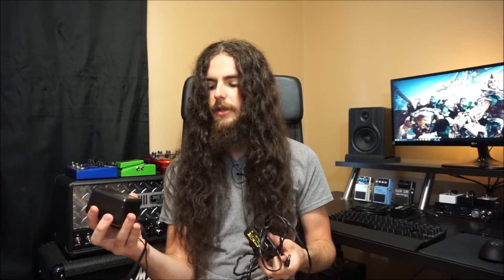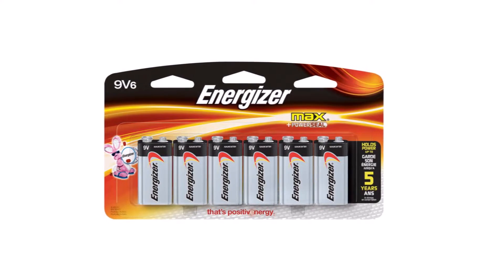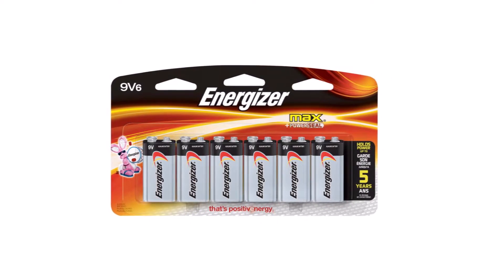A good indicator is if you have a big wall wart or a big brick, then it's probably AC — but always read the label and make sure it is a DC power supply if that is indeed what you need. The next critical spec is voltage. The vast majority of guitar pedals and multi-effects units run on nine volts, so one of the jobs of this power supply is to step down the voltage coming out of the wall socket to nine volts.